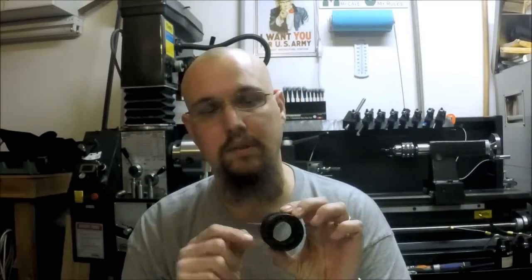Checked online, I cannot find them anywhere. All the forums, the few people that I saw mentioned in the forums that had purchased this, said that they installed it with a strap wrench. They just took it hand tight and then did the last little bit with a strap wrench to align the hole for the gas tube to go through into the receiver. I don't really feel comfortable doing that. I'd rather do it to specs.